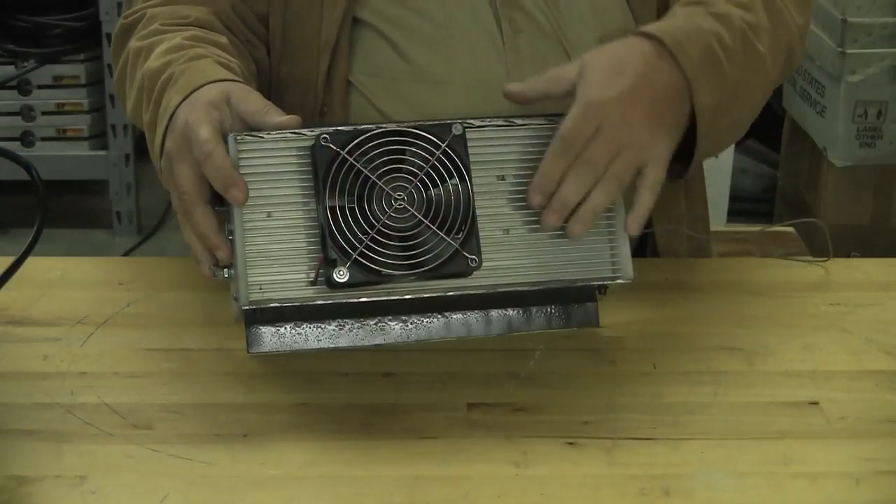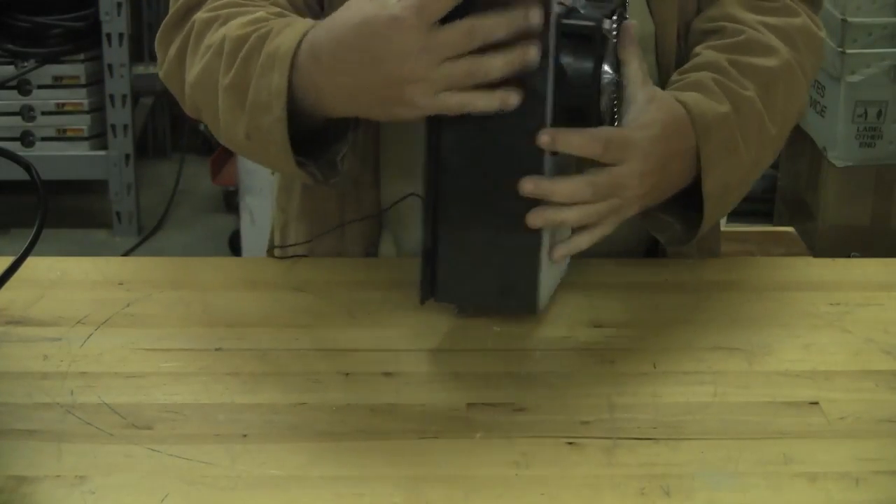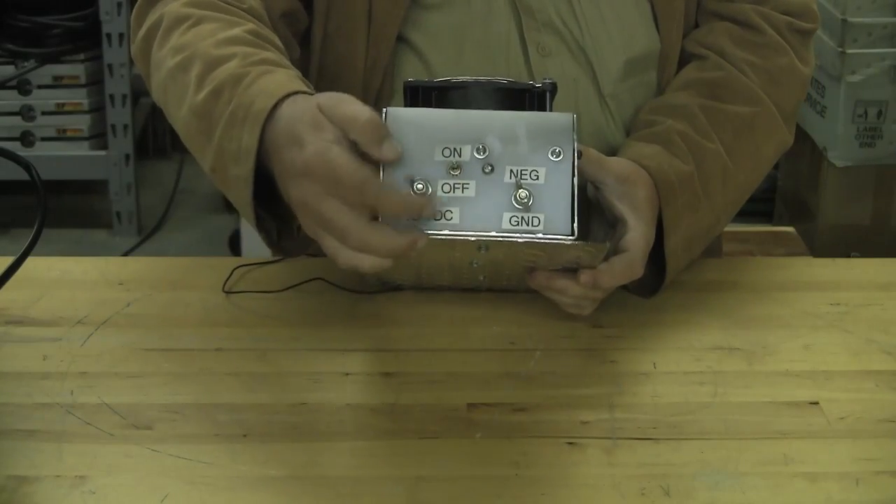You do need to mount them on an aluminum heat sink to get rid of the heat. If you want them to put out 200 watts, they don't do it by themselves — you have to have them clamped down with thermal grease on a heat sink. The ones I used put out 350 watts. I think I've got four of them in there. I put this on the bench with a constant current load, measured the voltage, and it kept the voltage up and did 120 amps out into my big dummy load for over an hour. That one's a monster, but it's fan-cooled with a heat sink. You kind of build those yourself — that's the best I can do on the high-voltage end.